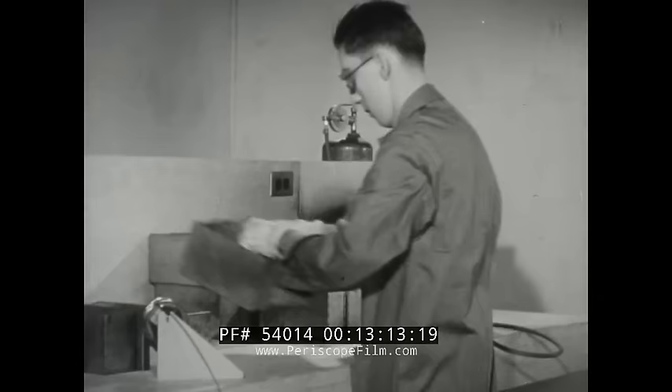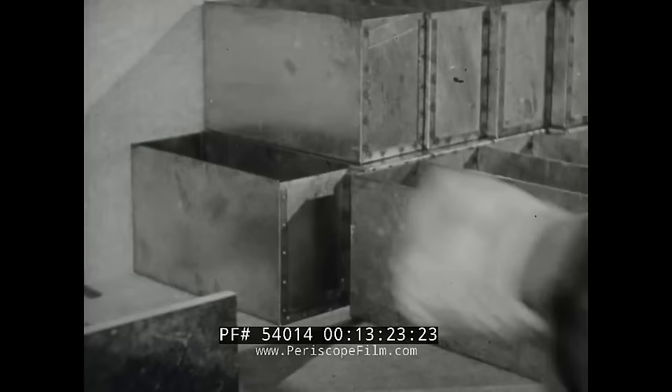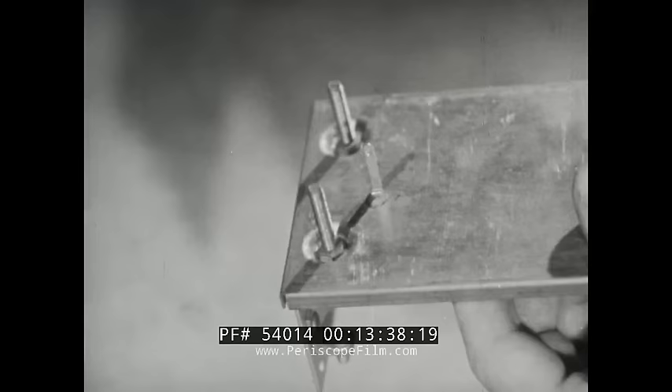When all seams are finished, inspect the job to be sure it is perfectly sealed. These cans must be thoroughly cleaned before use. As the covers for the cans cannot easily be cleaned, a rosin flux or a rosin core solder must be used to prevent corrosion.